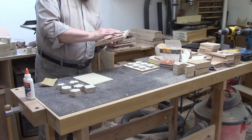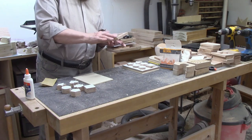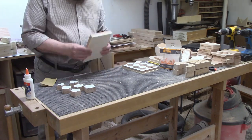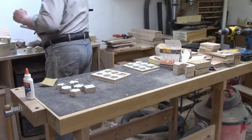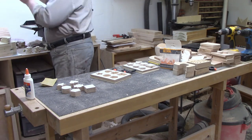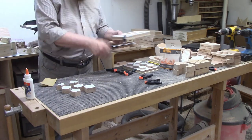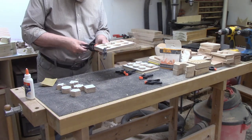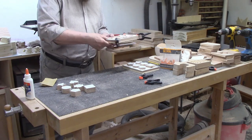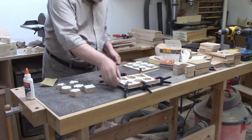This assembly is three-quarters of an inch thick, so those mini clamps aren't big enough, but I also have a supply of medium-sized spring clamps. I'll put one on each corner and one on the middle of each long side. I'll do the same on the second puzzle, then set both aside to dry, probably overnight. I can just peel the patterns off the geometric shapes since I attached them with scroll saw tape, but I used spray adhesive to attach the patterns to the frames, so it will likely take a few minutes with a random orbit sander to remove those. Then everything will be ready for finishing.